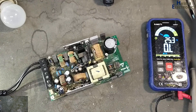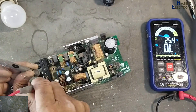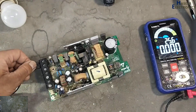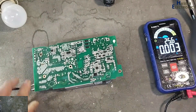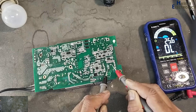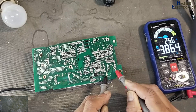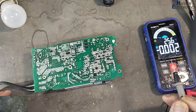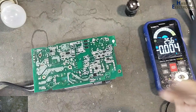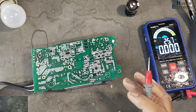LED is now turned on. Output reads 23.93 volts — that's excellent. 386 volts is maintained on the DC bus. Just only two things were needed: this capacitor and the fuse. Now I will arrange the original value components, and this power supply is now functional.